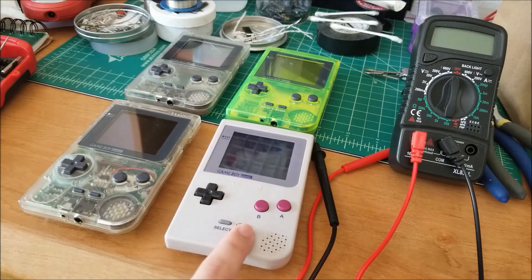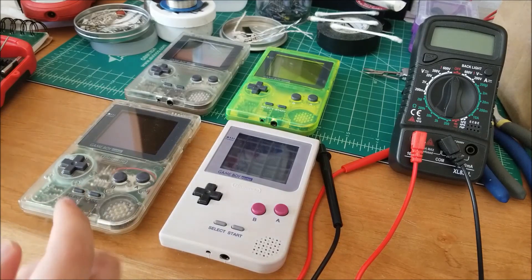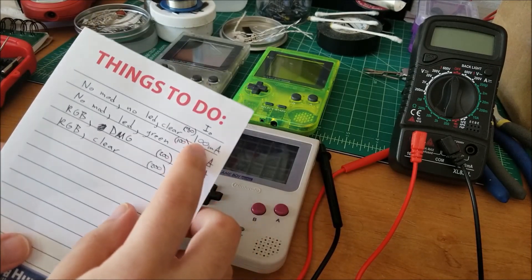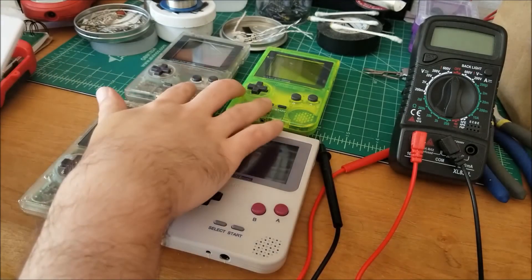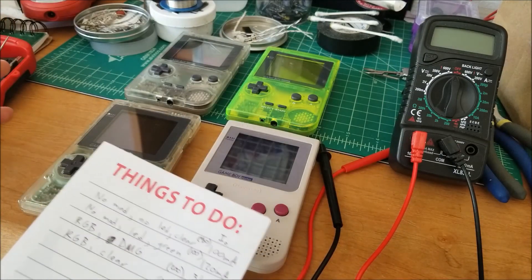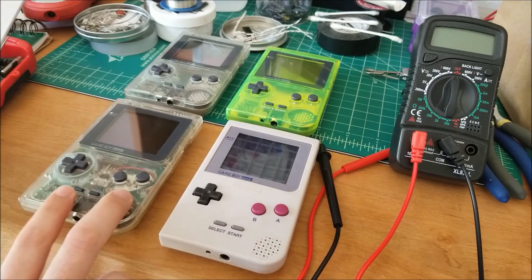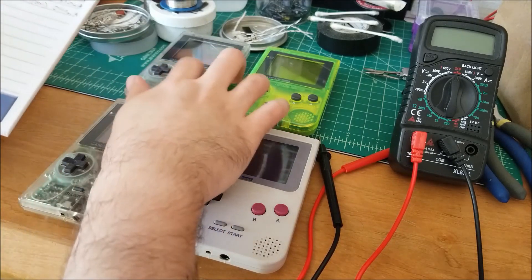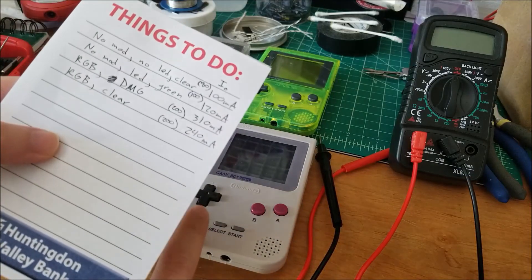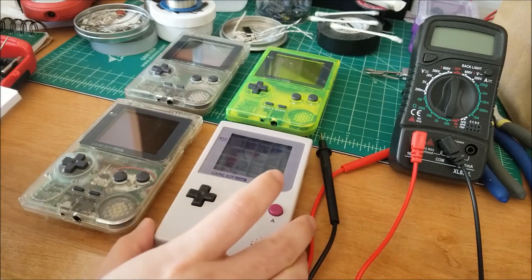Even though the simpler-wired unit was easier to set up, you'll probably get a little less battery life — about 60 to 70 milliamps difference. The two unmodded units will be fairly close to Nintendo's original specifications. The simpler modded unit will have a little less than half the battery life of the no-LED unit since it draws just over double the current. And the high-draw RGB unit would have about a third of the runtime of the no-LED unit — it just guzzles so much more current.